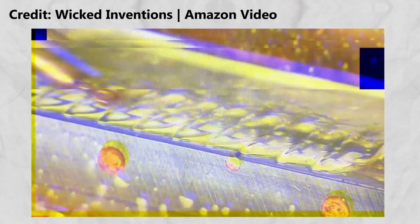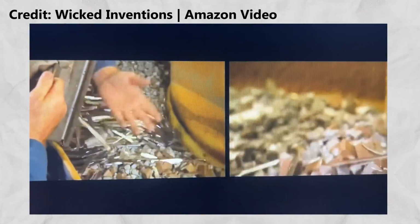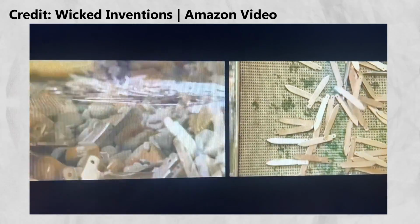This single coil of metal can produce enough steel for 30,000 blades to be punched out. The other tools, such as the can opener, files, saws, etc., are punched out in a similar way. Then a machine with stones and water vibrates, rubbing up against the steel tools, and the metal is polished clean. Once polished, the metal blades are picked up by a powerful magnet.